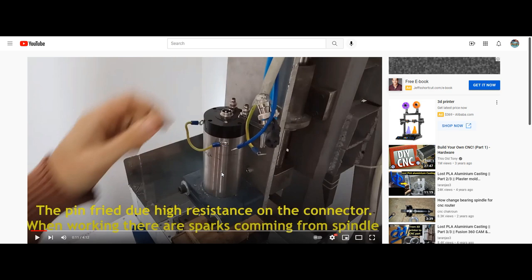But I'm telling you right now, one thing I know is doing something like this, number one, it's extra work. If you remove the end cap, that's extra work. You have to ground the actual chassis of your CNC router or robot anyways. Do that, ground it properly. When I say properly, 3 ohms or under is considered grounded for robotics. How do we get to that low number of ohm rating? Well, all we have to do is add more contact points on our chassis. I always recommend doing a four-point grounding. That means on all 4 points of the chassis.